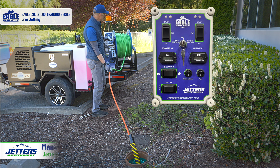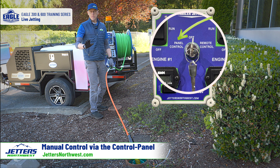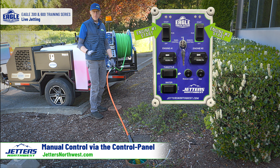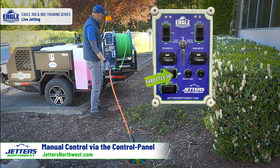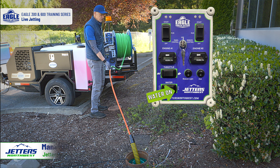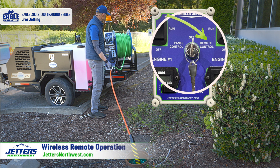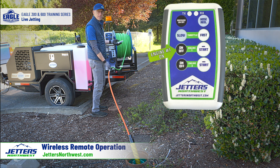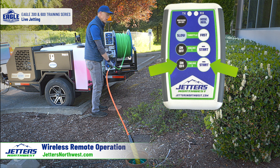We showed you the manual operation before. If you're going to run manual, you turn to panel control and then turn your engines on. It's important that as soon as you turn the engines on, the pumps are wanting to pump — so even if you're just warming up the engines, there needs to be water in the tank, otherwise you're running dry. If I was running manual, I'd start it up, let it warm up, and use the water on/off control to control jetting. But most of you will be using the wireless remote, so I'm going to switch to remote control with the key, then start up with the on button.